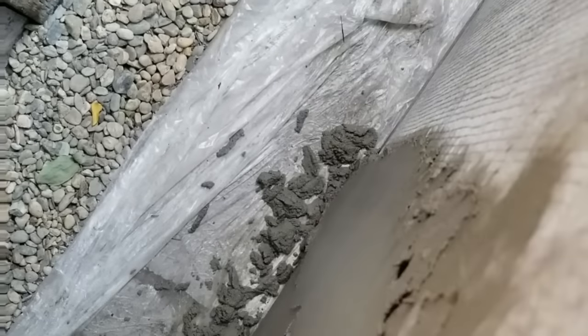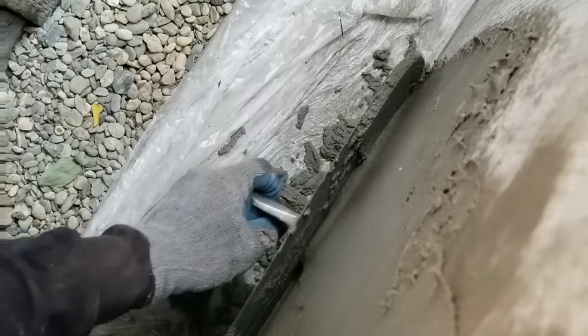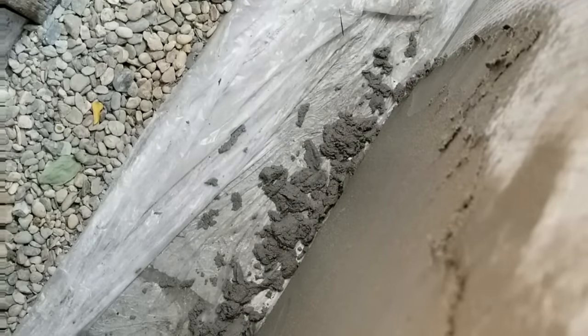So here I've started a little bit — there are some uneven spots, but once it starts drying a little bit you can work them out. The sponge is really going to help even it out. You start at the bottom and work yourself up, try to even it out. There's an uneven spot there — you go ahead and bring it this way. You still have a little bit of low spots, so I'll work those a little bit better.